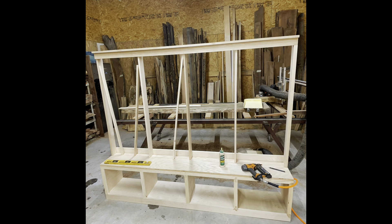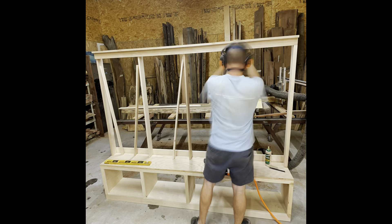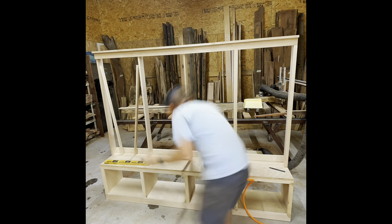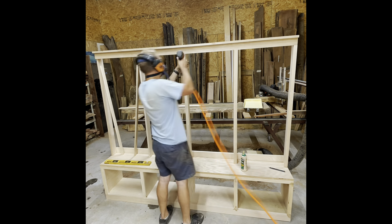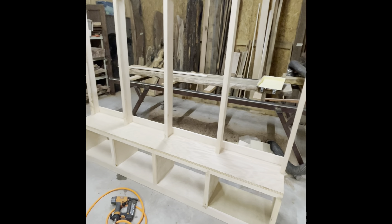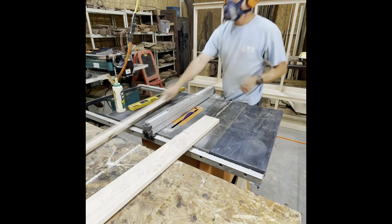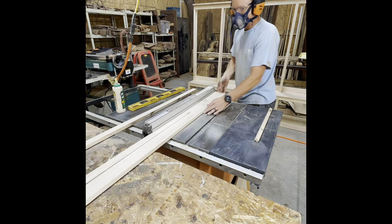This is maple. Maple is very expensive as far as cost goes, but it is a much more robust product. It is a harder wood, it won't bleed through, and gives you a much better quality. If you're not sure what to use, you can look up a local hardwood supplier and go talk to them — they will guide you through the process of material selection.